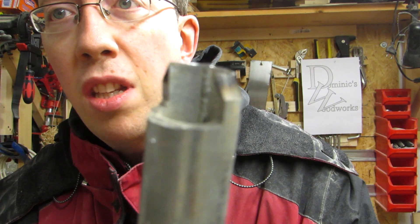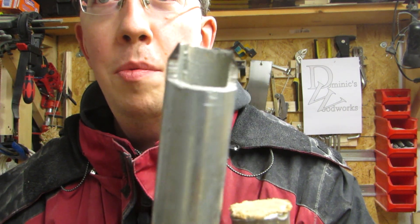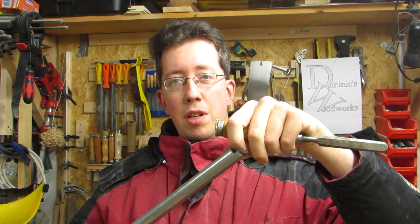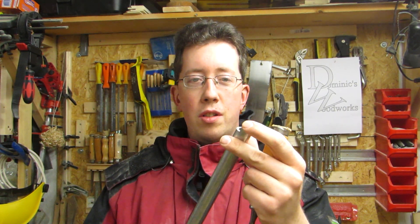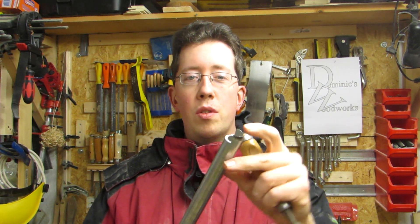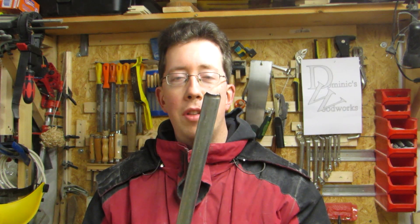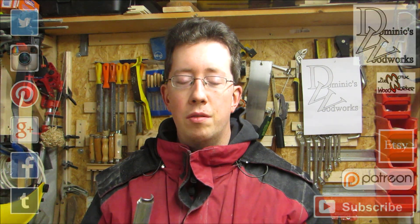It's far from perfect, especially because — I don't know if you can see this — the inside is not really flat. It's not sharp either, so there's no proper cutting edge most of the time. I did notice this bulge in here — the pipe is welded. You can't really get a cutting edge there, so this part of the gouge is much more effective than this one. I also thought about doing it without cutting something off here. There's one disadvantage and one advantage: the advantage being that I might be able to attach dust collection so the chips would get sucked out of the way; the disadvantage being that I can't see what I'm doing. But how can it get any worse? It's an experiment — I think I'll be trying to improve it just a little bit before getting into a carbide chisel, or maybe I'll come up with another tool.